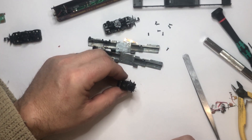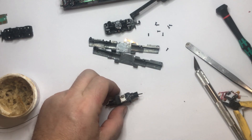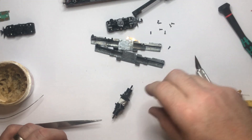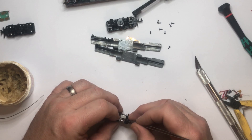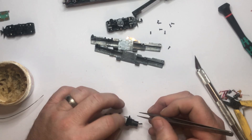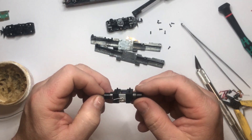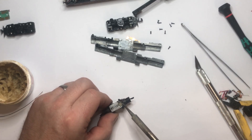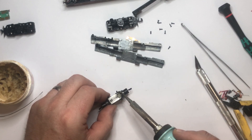What I'm going to do is put a little bit of wire on the bottom contact of the motor. I've soldered a grey wire to the motor contact at the bottom and to the chassis - you can see that in more detail. So the power will come around the chassis. Before I start putting it all back, I'm just going to clean up the motor contacts on top either side, and then we're good to go.